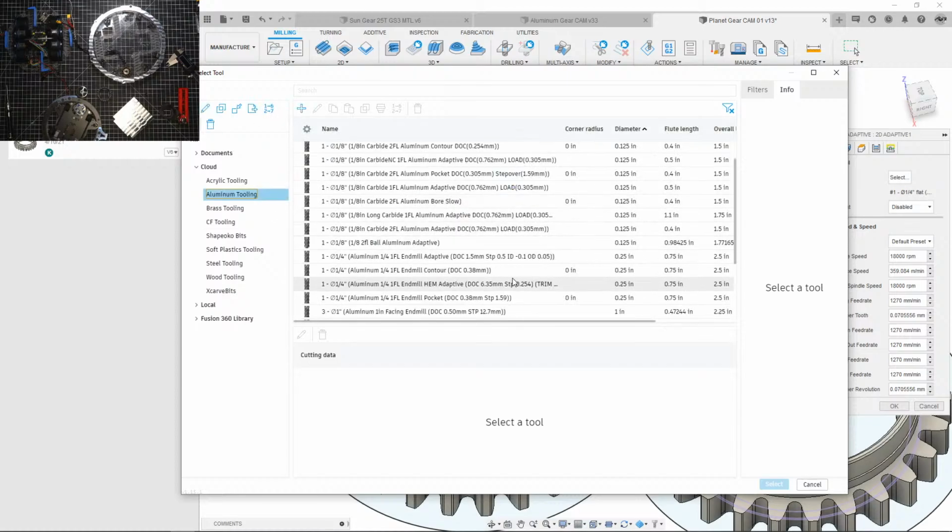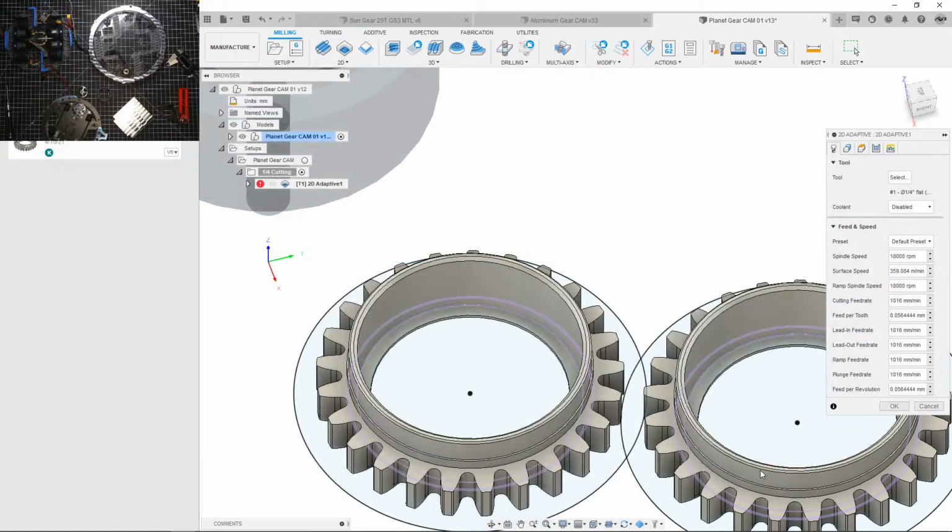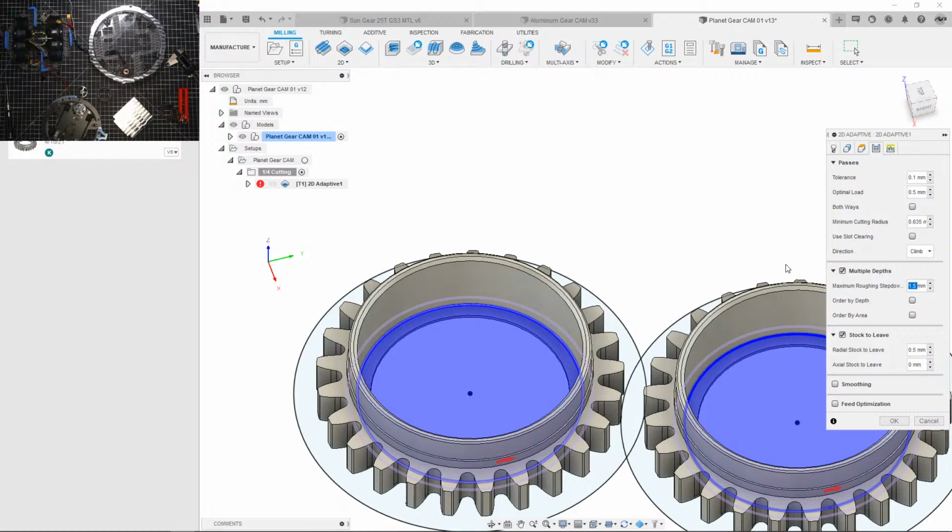or my regular adaptive recipe, which is, here is it? It's somewhere here. I think it's this, yeah. Oh no, it's red. I'm gonna change the depth to 2 millimeters now because I did upgrade the spindle, so that should definitely be able to withstand the deflection a bit more.